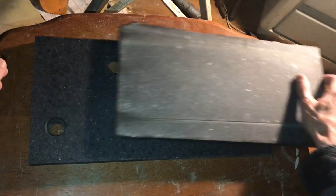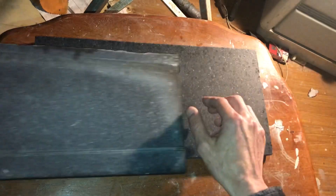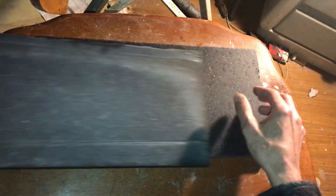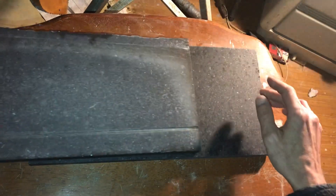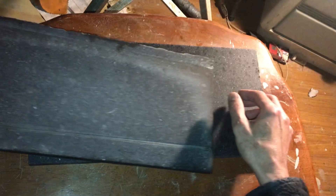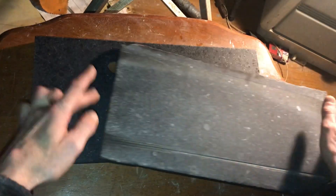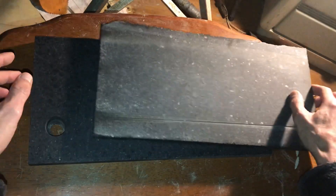This is one way to challenge claims of flatness in regards to lost high technology. The light will give it away, but just put another flat surface against it — if it floats, it's precision. This was done with sand and water and just a bit of a rhythm to the polishing. I have to be careful it doesn't fly off the table. Before I started filming, my finger was just flying around — you could breathe on it and make it move.